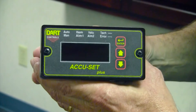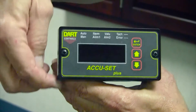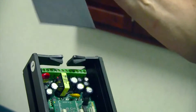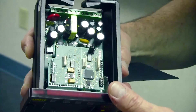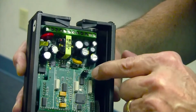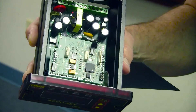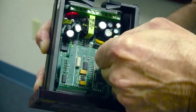Let's look at the ASP. This is an ASP 40 — it's a panel mount device. It comes complete with a gasket, so when you mount it into a panel it's a watertight seal. Inside, the top board area has three connectors to accommodate some of the options available for it. There's a jumper that controls whether you're able to program the unit. From the factory it ships in the on position, and when you're done making your program changes you just move this jumper to the off position.